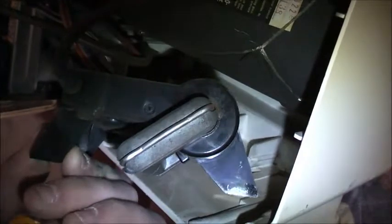Easy replacement, swap in and swap out. It's one of the flattest and most unique flybacks I've ever come across. That's a very unique thing about this TV. It works quite well too, it's a bloody good picture. Sits in like that. The ferrite's on an angle, I suppose there's a fair bit of room in there for a good secondary. I mean primary. Bolts on, clamps. It's got a fairly thin cable though, so it's probably a low output flyback. Doesn't say what the voltage rating is. Probably only a little 30 kV flyback. Most flybacks are anyway.